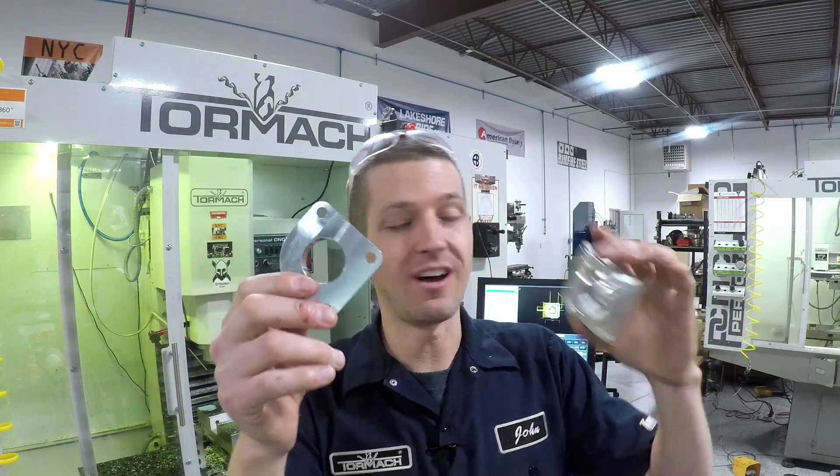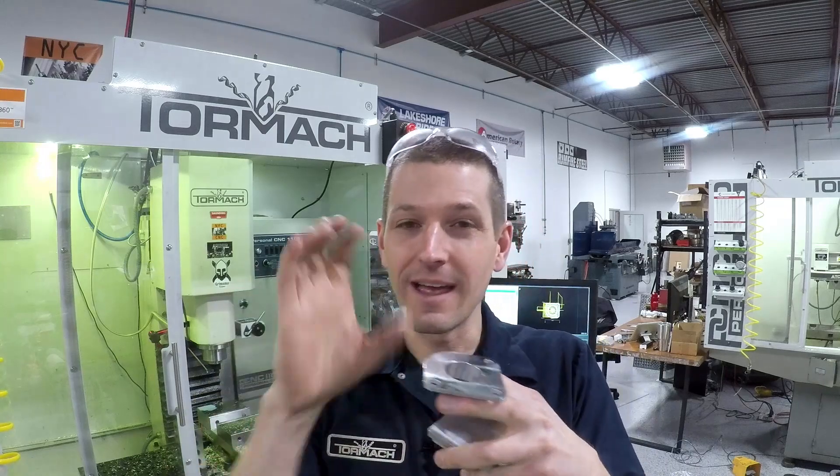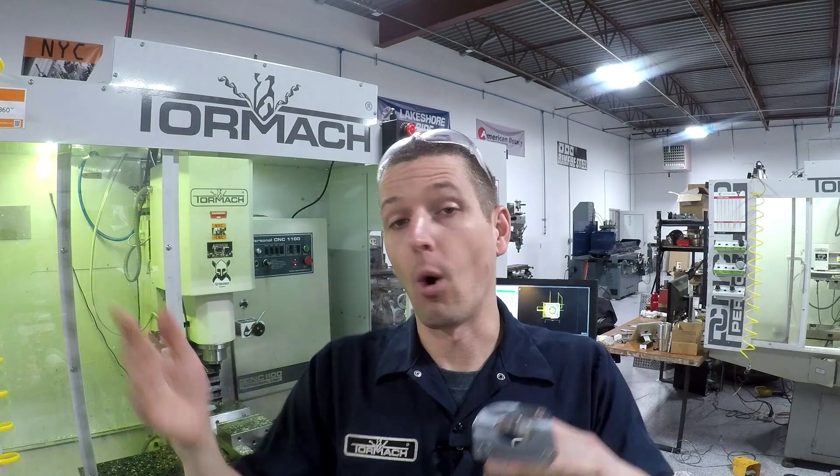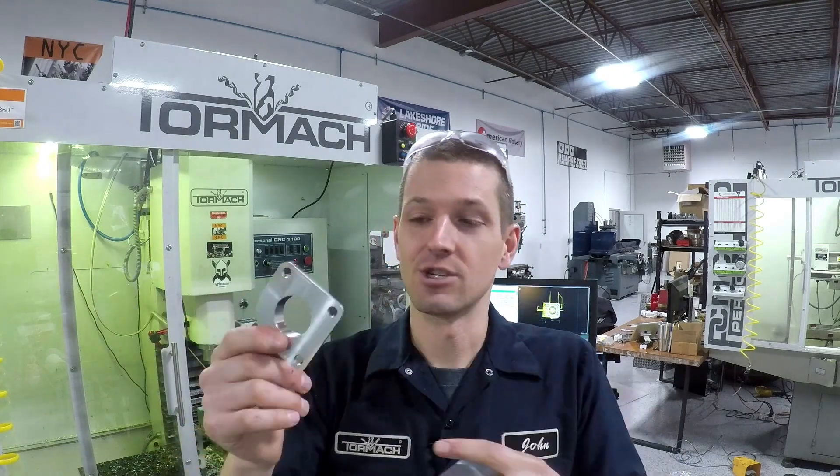We decked off the backside, as you saw. I didn't do it on this one because this is such a thin part — as you clamp it, you're springing it up; it's just so likely that you're going to rip the part out or blow your tolerance. We can cover how to do that properly in a different Wednesday Widget. Folks, I hope you enjoyed, I hope you learned. Take care, see you next Wednesday. And thanks again to Rob Lockwood for the collaboration.